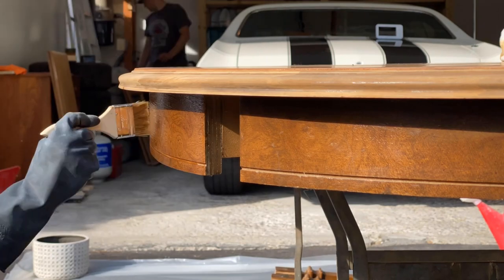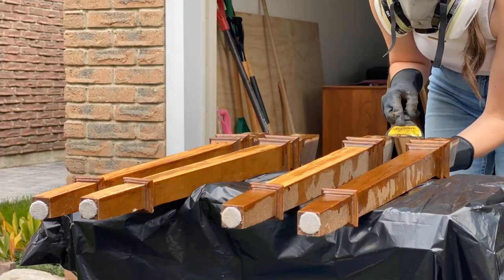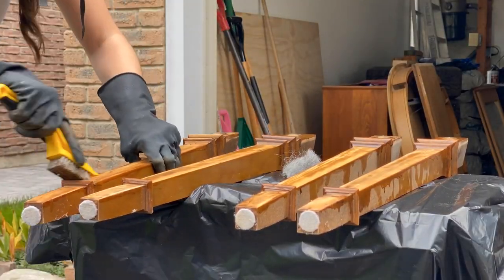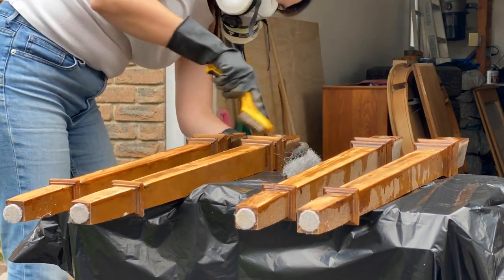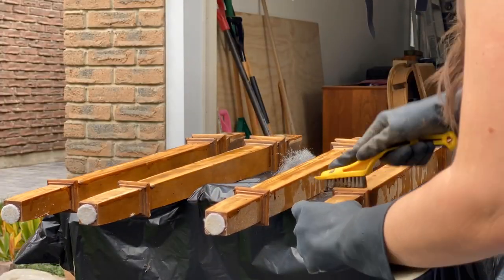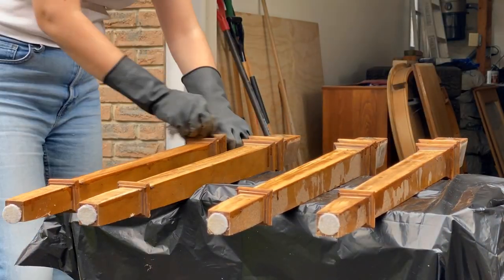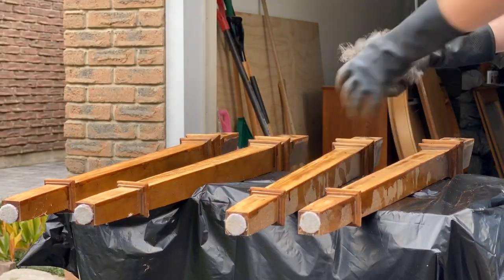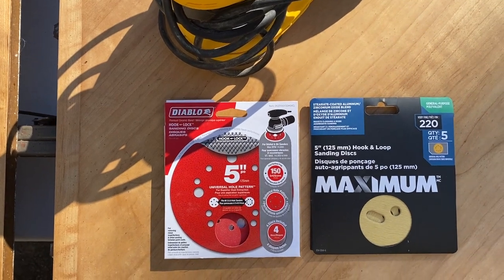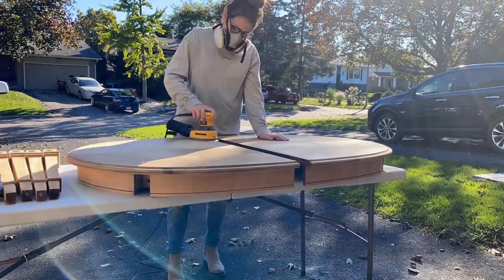The tabletop is solid wood, but the skirting is a veneer, so the stripper was definitely the right route to take on this so I didn't have to risk sanding the veneer too much. The table legs were a little more difficult to strip, but I focused on using the wire brush and steel wool to scrape the finish out of all the cracks. I followed the same process of applying the stripper and then worked away at each leg, one side at a time. After giving all the pieces a few days to fully dry, it was time to finish removing any remnants of the original finish through sanding.